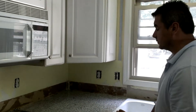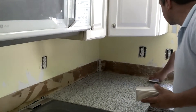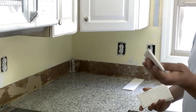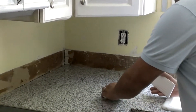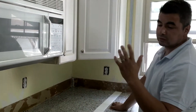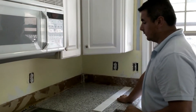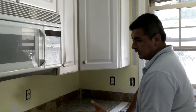To achieve that, just take your tiles and start calculating — maybe cut one in half and lay them out along the full length. Sometimes calculations end up a little off, maybe a half inch or quarter inch, so you want to know how much will be left in one corner and decide based on that whether you want full pieces and halves at the corner, or whether to start from the middle and work your way to the sides. That's up to your consideration.